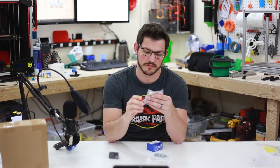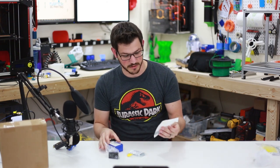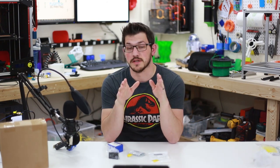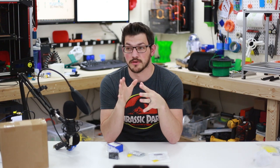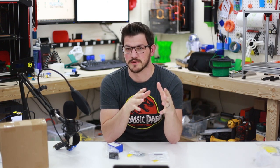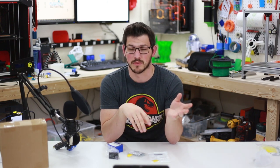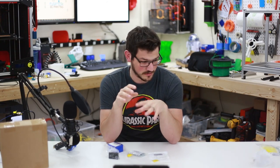I also got M3 by 10mm screws, M3 by 20mm screws, and a bunch of M3 nuts that I'll need for a lot of things in the Hypercube. The stock Hypercube parts do not have the captive nut holes for M3 nuts, so I've downloaded and printed several that do have captive nuts. I'm going to do the stock parts first — most of them — though there are a few I really don't like and I'll change immediately. A few stock parts I'll use, a few I won't. I'll change them later, explain why I like or don't like them, and go from there.